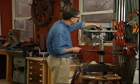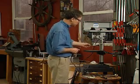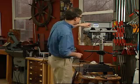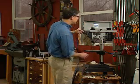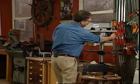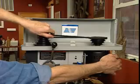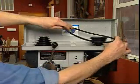But to change the belt speed, what you want to do is first check out the tool. In this case, this is a 1/4-inch bit, and we want to run this at 1720 revolutions per minute. To adjust this, release the lock on the motor, pull the motor forward, and carefully work the belt off of the smaller end of the pulley.